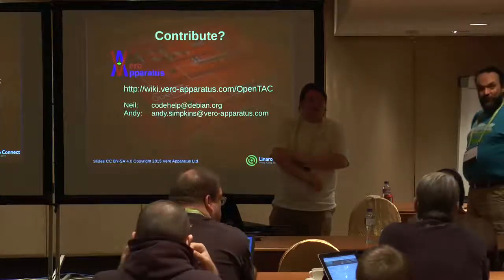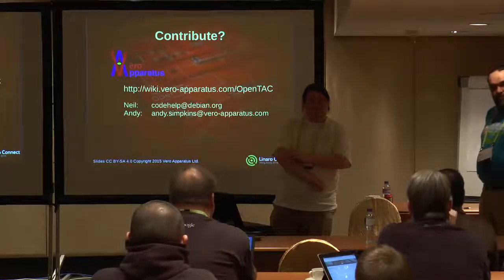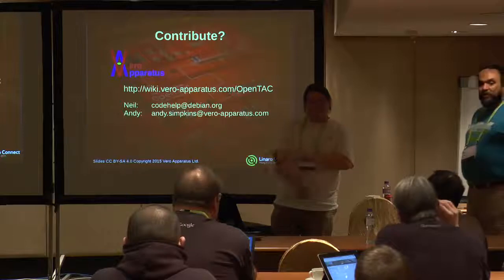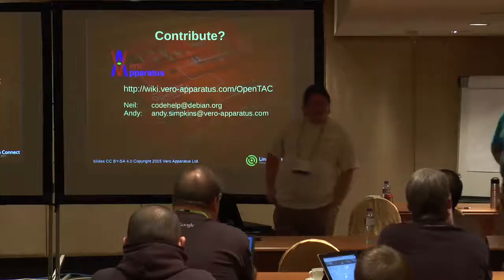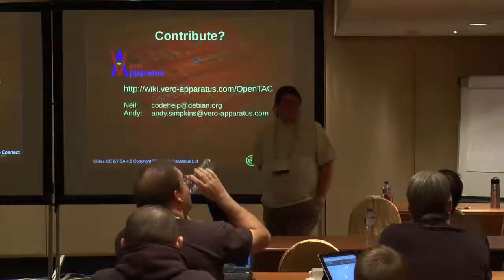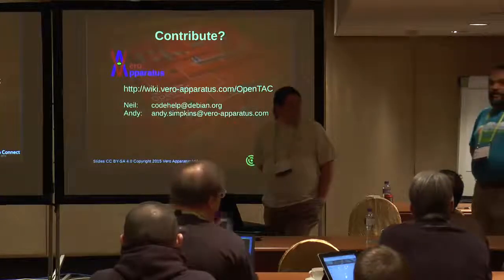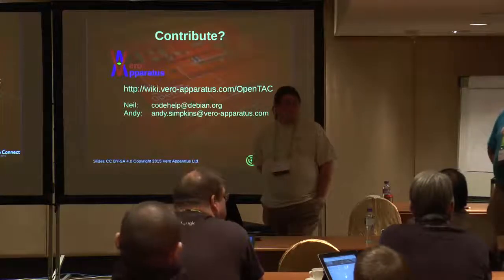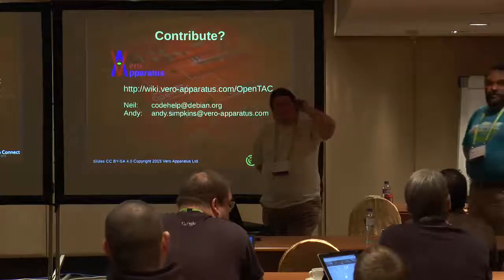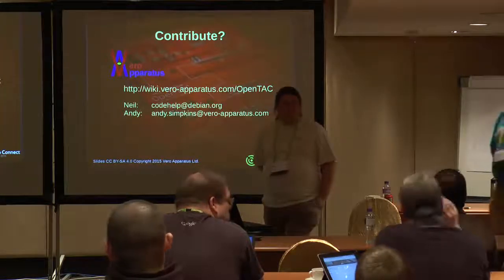I've got a question about that because I've had terrible reliability problems with the USB serial. Yes. And more so when I've tried to do it on a BeagleBone Black. So there are changes that have gone in with that. You're using Rev B BeagleBone Blacks. There is a known issue with those, and we are speccing Rev C only of the BeagleBone Blacks for this. You're also not using the absolute latest mainline or BeagleBone kernel on that BeagleBone Black. You're also using commercial USB hubs. So there are other failure points within that, but yes, it is something that we have taken completely into account.